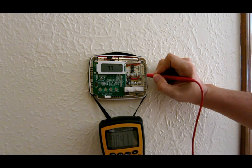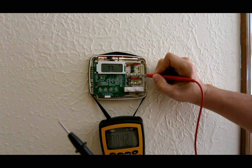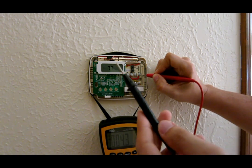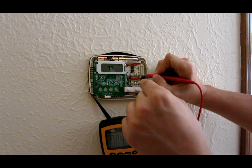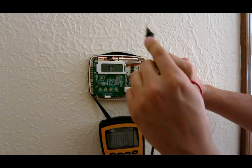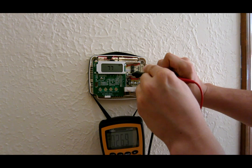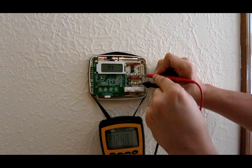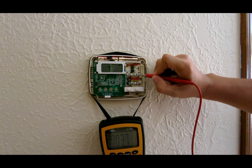The reason my digital multimeter says four volts is because it's an AC signal — you can always pick up a signal, but it depends on where my reference location is. Since I don't have a reference, it's reading four volts relative to air, so we can ignore that. But basically there is some voltage on there and I know it's going to be about 24 to 26 volts. If I measure the white wire — for the furnace — you can see 27 volts. Same for yellow: 27 volts.